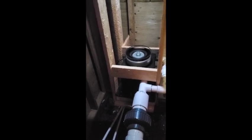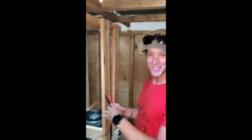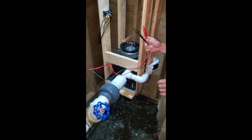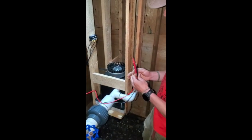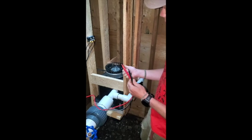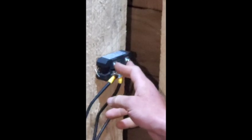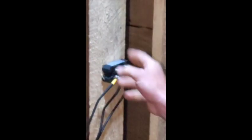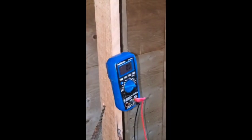Oh, that is pretty. The whole microhydro system was fun to build — now we're getting into the scary part. We're going to see how many volts this thing produces when it's unloaded. We have the rectifier hooked up with our three AC wires and we're going to measure the DC volts coming out of the rectifier with our multimeters. Cross your fingers.